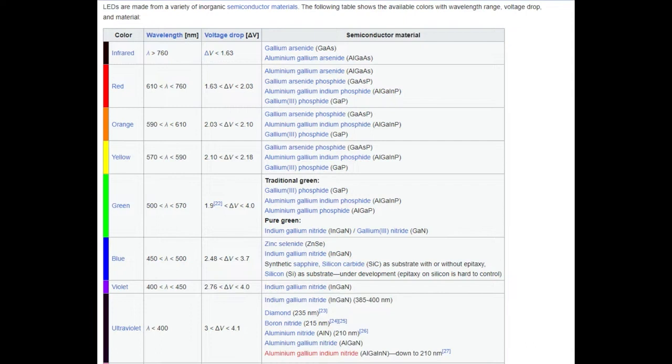A lot of low-cost LEDs, even illuminating ones, are not going to be matched. You're going to get whatever brightness came off that disc when they diced up the silicon — the PN junction — and each plate might be a little bit different, and that's kind of your problem.